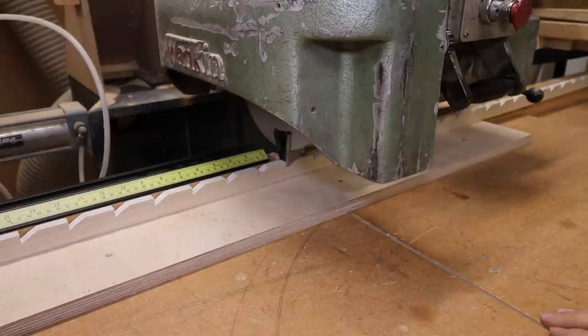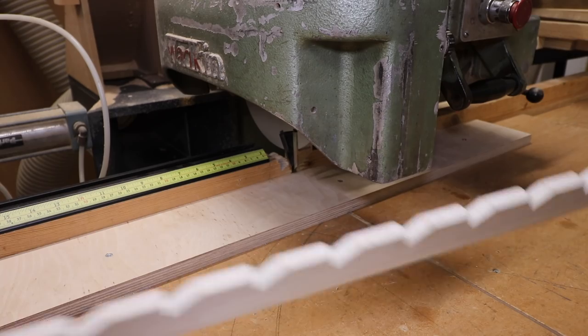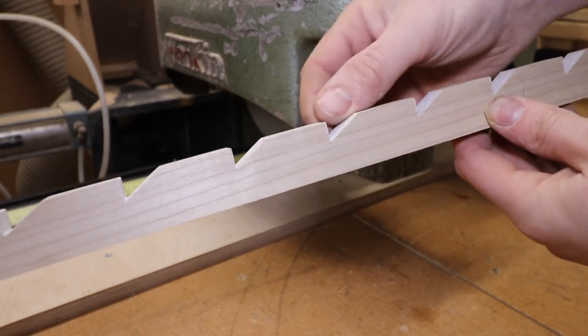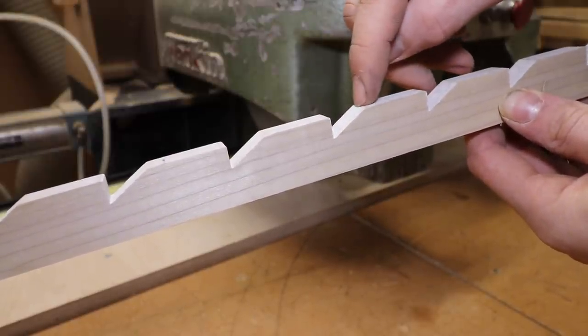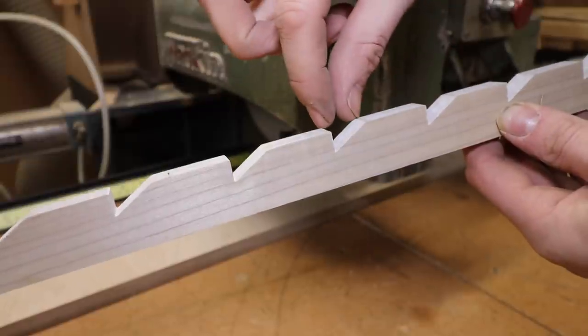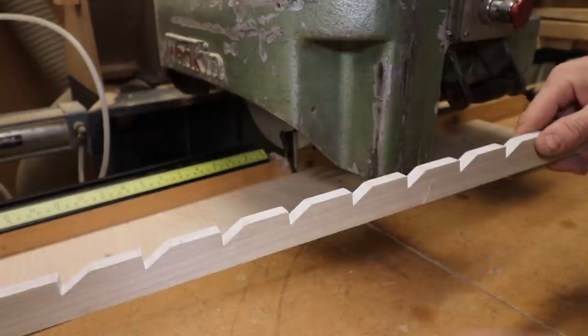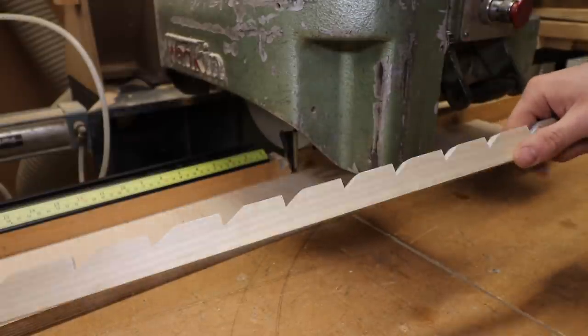If you've not got something to set this off, what I'm aiming for is the amount you're notching away from the timber. So from this point here to this point here where it exits the timber from the V, the height of that wants to be the same height as the pieces of timber that you're going to use to span between the two shelf strips that's actually going to hold the shelf up.